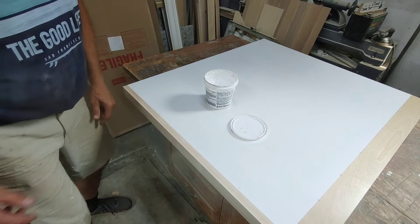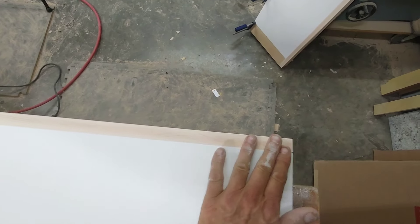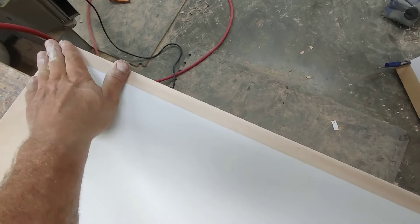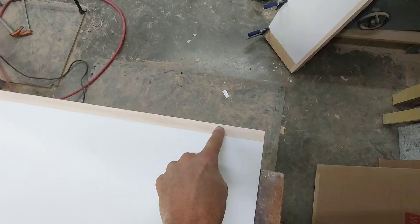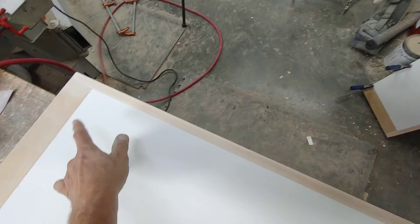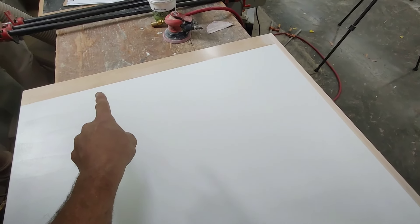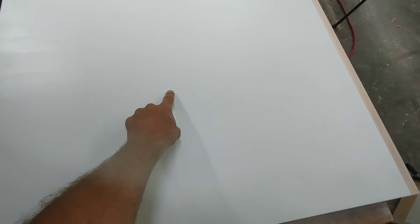I've got it done here, it's all nicely sanded flush. I can just feel that line all the way through there, and even if it's up just a little bit it really won't matter at the end of the day. Now I've got this post on here and it protects that surface so that if it gets hit on the edges it'll withstand some abuse. I'm going to be adding a baseboard that gets wrapped all the way around it — that's the reason for this piece of plywood. Anytime I'm using a melamine surface, especially for an end panel, I'll put a little bit of plywood at the bottom, about two inches, and that way it protects it and gives a great surface to paint on.